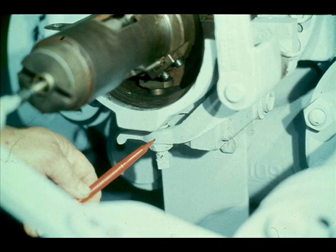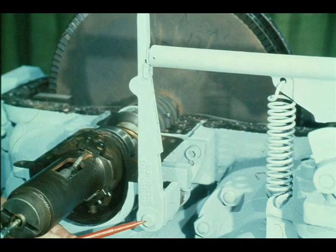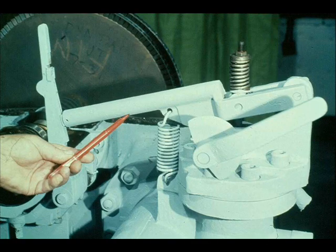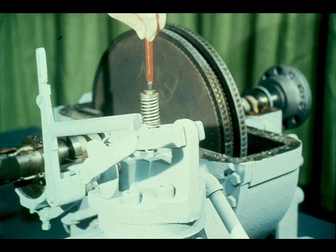The trip pin pushes the plunger down against the end of the trip lever at the bottom. As the trip pin forces the plunger down against the trip lever, the lever pivots on this shoulder bolt. As the trip lever tilts, these knife edges disengage, releasing the resetting lever on the right from the trip lever on the left. Once the knife edges disengage, the resetting lever is pulled down sharply by a spring to the tripped position, slamming the overspeed valve shut. The position of the trip pin in the governor case has set off a chain reaction that shuts off the flow of steam to the turbine. This overspeed trip mechanism is an emergency safety device that operates only when the turbine accelerates too much over the operating speed.